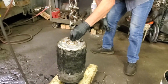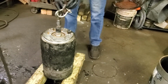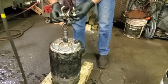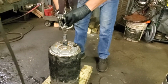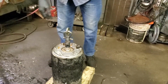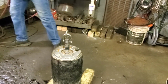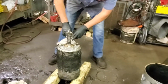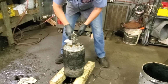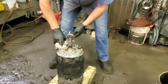Maybe, you know, the Flygt pumps are good like this. Sometimes they run about 5 hours and they overheat. They stop, and they cool off. And it's still good, and they run it again. Another 5 hours, they stop. They reset the breaker and run it again. Gotcha. So maybe it heats up after 5 hours, trips a breaker, cools down, heats back up, runs again 5 hours. And that probably happened repeatedly over and over again. Yeah.